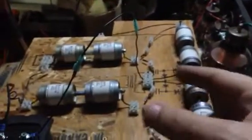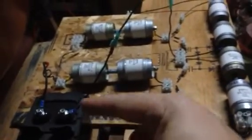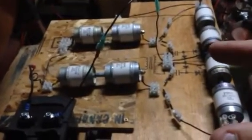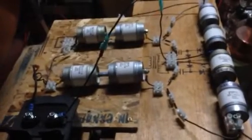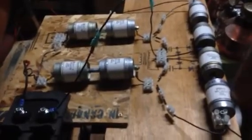And then here's the configuration, right? This is the input, so the AC comes in here, 120 volts, 60 hertz. It's an oil ignition transformer, comes out. It goes into just any full wave bridge rectifier that you can find on the net. And the output of this transformer is rated at 10,000 volts, 23 milliamps. It's quadrupled and then some, because that's measured already at 50,000 volts, using a pair of high voltage 0 to 30 kilovolt DC meters in series. And that's about 800 pF, roughly, of total capacity at the 50,000 volts. So, that's the ion chair. And those are the current measurements. Sorry if it's a little long.